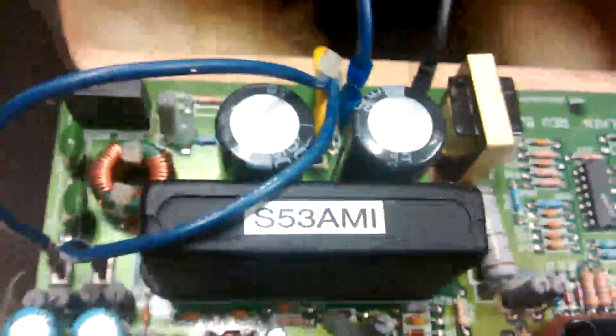So this one would need to be replaced, and the other one we replace together — we replace both of them. If they lose capacitance, they cannot filter the AC coming from the rectifier anymore, and that is what you hear at the output of the amplifier.